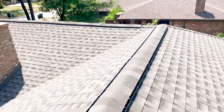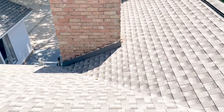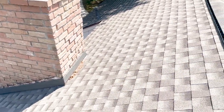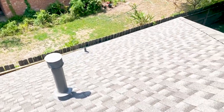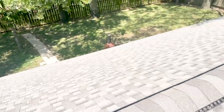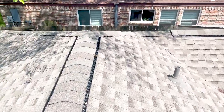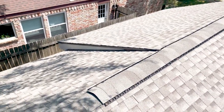First really good sign: we have a brand new roof on the property. They reflashed all the chimneys, which looks really good. They did not put a cricket right here — we typically like to see a cricket on a brand new install. But they replaced all the boots and all the flues. You got a boot over there that's heavily tarred; it looks like it's old, but that is new. All the fasteners are sealed and they got a new drip edge right here on the side, and really good flashing.